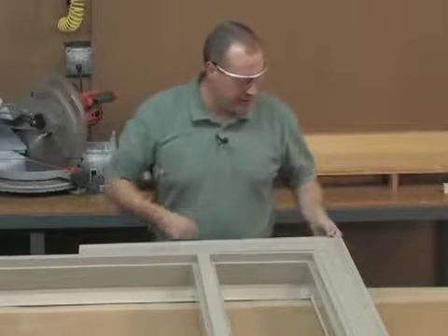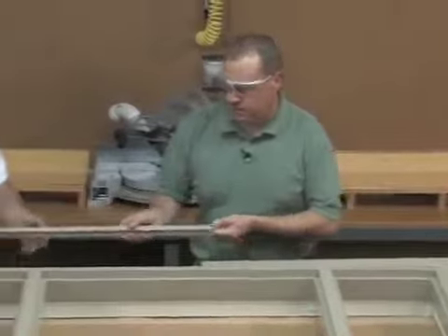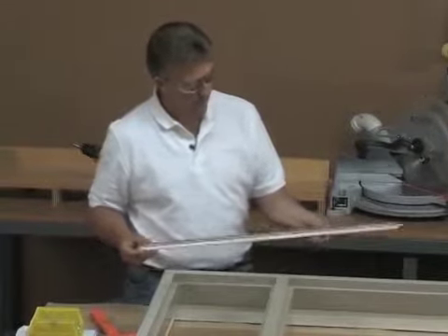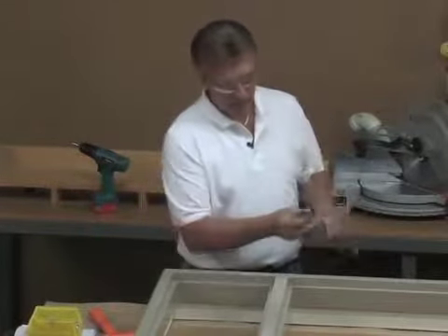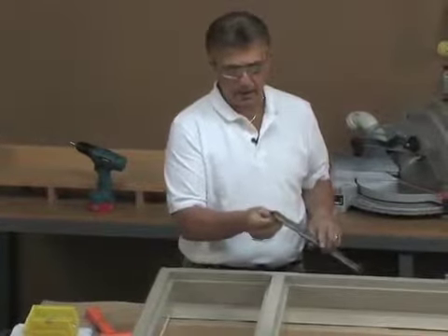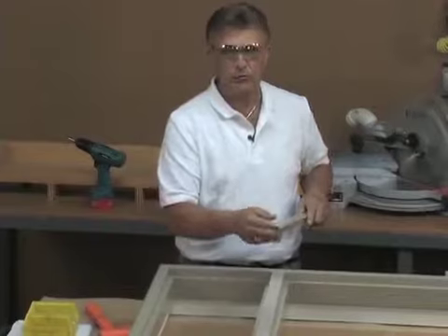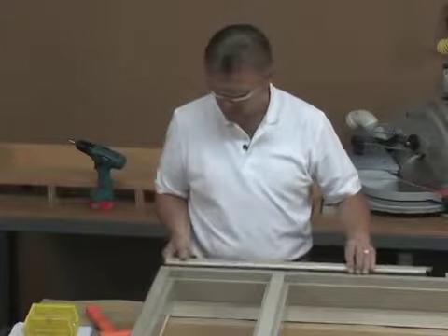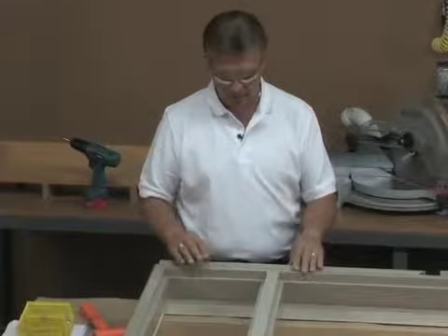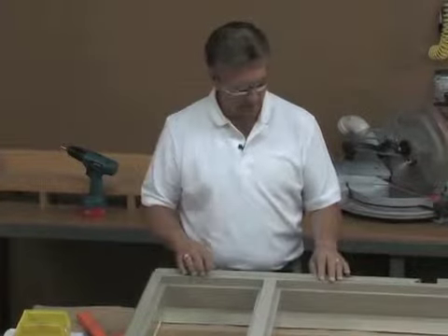These are a couple of different choices you have here. This piece that we call backband also has another purpose besides being snapped on to the outside of the three and a half inch casing. You can apply it directly to the crown line casing — it does have a receiver on the backside. We refer to this as our backband with built-in J-channel. Some contractors like to be able to tuck their siding in behind this without the use of a vinyl J-channel. So they can snap this directly onto the crown line, and this is the exact duplicate of the wood 180 brick mold or the same as our aluminum brick mold by adding it to the crown line casing.